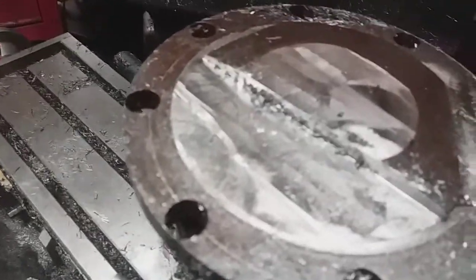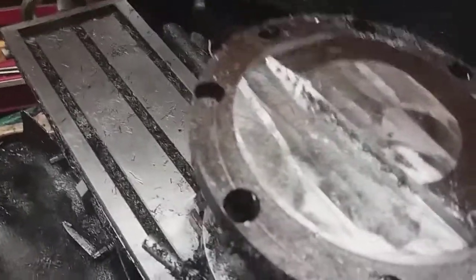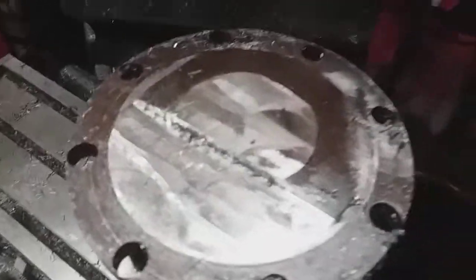So when I'm trying to spin at 3,500 RPM, 4,000, something like that, I've got something, a scatter shield basically, because I think the surface finish will be better. Running this at low RPM with that facing tool that I have, if you see it on my other video, I'm not going to get it out, I've got my hands full of stuff right now. But I think the cutting with this machine goes better going faster.